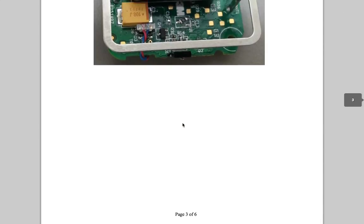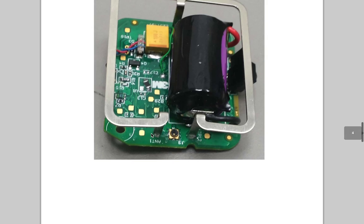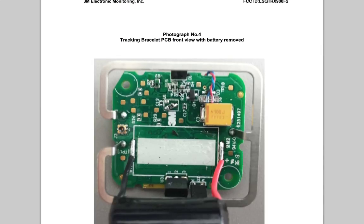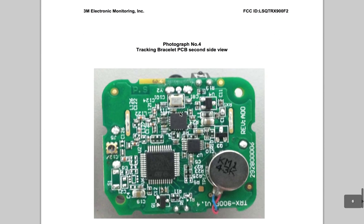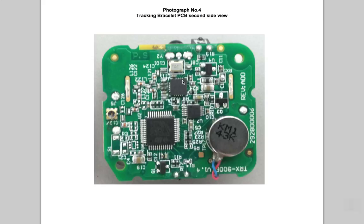We'll come back to that. But after that last board which was so beautiful and wonderfully done, this is depressing — it's just so bad. They've clearly taken a SOT-23 and replaced it with a little 0805 or 1206 resistor. Here's another view of the front of this circuit board. There's a bit of stuff up here but not a whole lot. The thing gets more interesting when we look at the bottom of the PCB: we've got what's probably a vibratory motor, an IR receiver, a little chip which is going to be the radio chip almost certainly, and then this bigger thing with ST on it is going to be an STM something — it's kind of hard to see — and then a little 10-pin jobber.